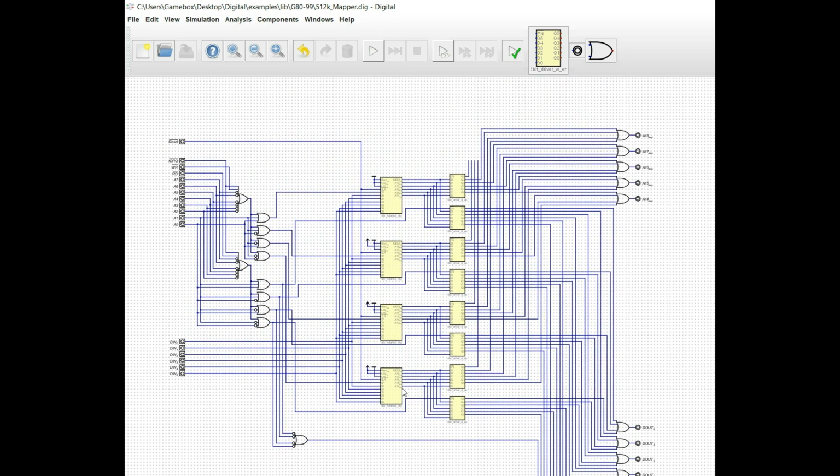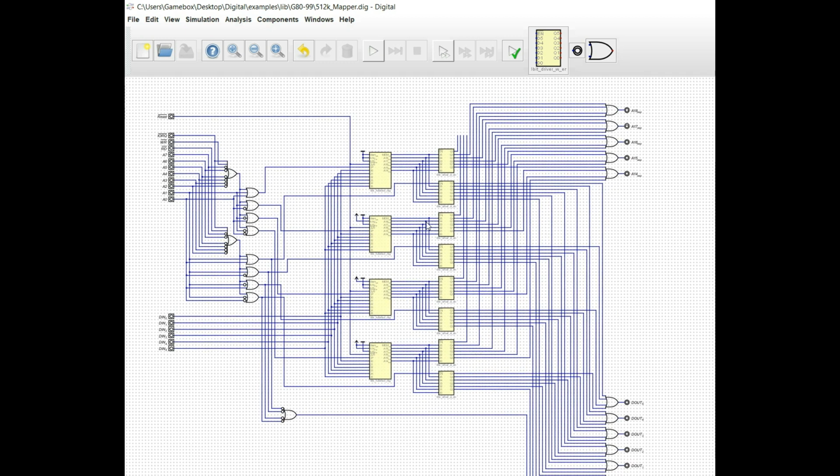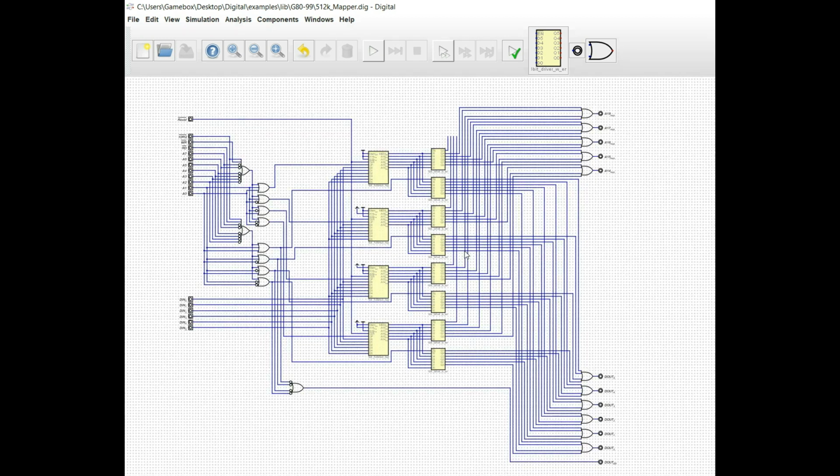Now what we need to do is actually use these signals here to create a RAM-ROM signal. And we also need to create some logic for determining which one of these chips is going to display its data onto the address bus, because we haven't come up with that yet. So we'll take a look at that next, and in the meantime, you might want to start thinking about the exponential growth, because as you add more things, you have to add more things. So your schematic is going to grow like this, and it is very easy to get lost. So bear that in mind. Now, like I said, we're going to take a look at creating some of those select signals next. So we'll get right at it.